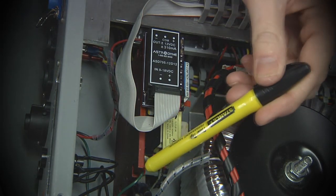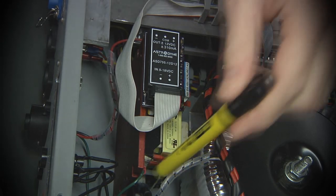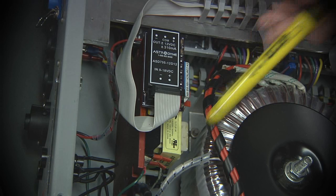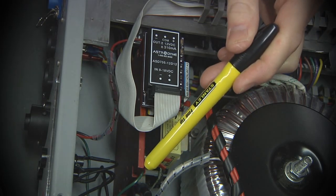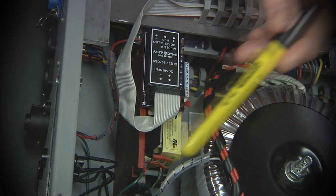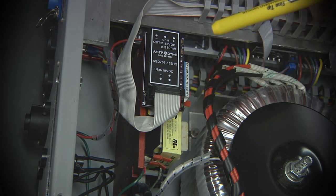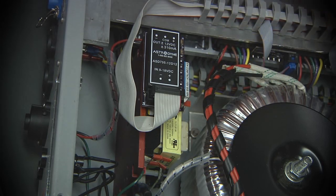What we're looking at here is the KBIC 125. Vertically mounted, basically there's a couple of screws just holding it to the floor of the enclosure. This is a nice little DC motor driver. It's a great upgrade from what was on my X3 milling machine to begin with. Has nice ramp up, ramp down control. Takes basically minus 10 to plus 10 volt input to control the spindle all the way from full reverse through stopped to full speed forward.